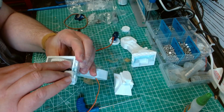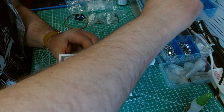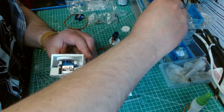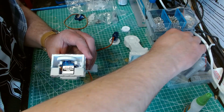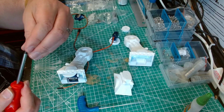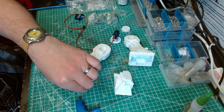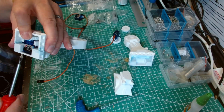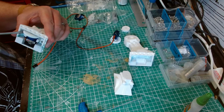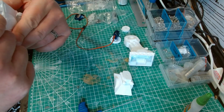So just hold it into place, and then we need some M3 times 5 screws. I have somewhere. Oh, I'm sure M3 times 5. Hey, is that M3 times 5? Yeah. Right. So you take your M3 times 5. You need 2 of those per leg. And you're going to attempt to get it in position, and it's going to self-tap into the plastic. And just pushing the wire to make sure it stays underneath that ledge so the wheel doesn't get interfered.